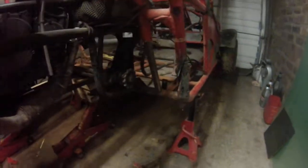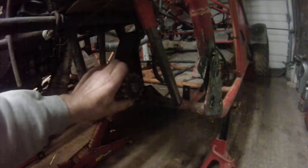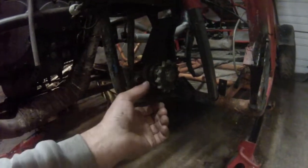I think our issue that caused it to slide was this sprocket. I think that broke its weld, which caused the buggy to go into one-wheel drive. And then doing that, it just put us into a slide. So that needs to be repaired. It's a bugbear that's been doing my head in ever since I built the thing.